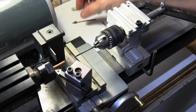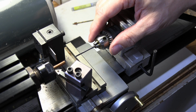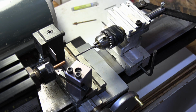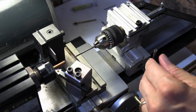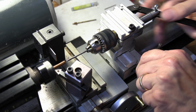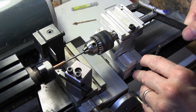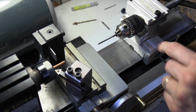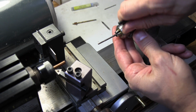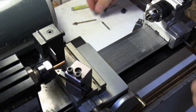would fit just right. But the stainless rods that I have in 3/32 are actually just a little bit oversized. So I bought the proper size reamer for that. So that's why I'm doing this. So just run it in and out a couple times. Doesn't take much. That cleans the hole up. And so we can take that out and slide this out of the way.